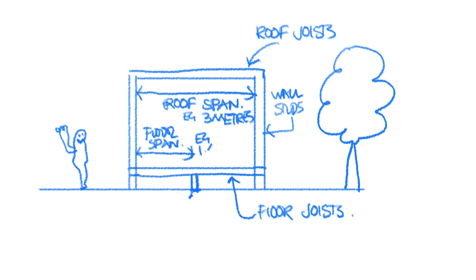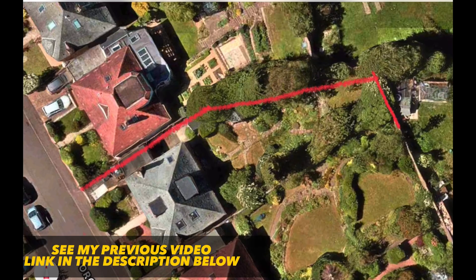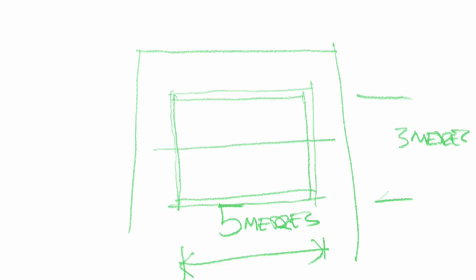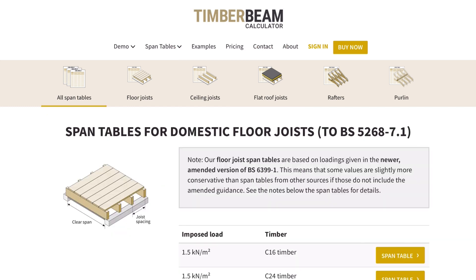If we were doing a pitched roof project, we'd be looking at rafters instead of roof joists — right, that's the jargon out of the way. We've sketched the footprint of our project using a site plan of our garden to calculate the maximum size. These dimensions will give us our maximum spans, which is the key ingredient. Let's start with our floor joists. I'm going to use span tables to help me, and there's a few sites that are great for that. I'm using this one — free to use as long as you stick to their generic tables, which is fine for us. I'll leave a link in the description.